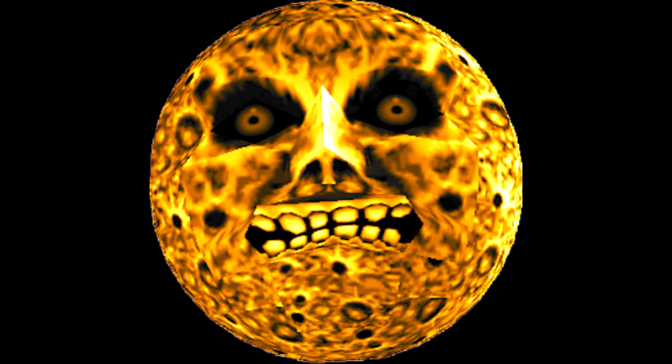There's another issue, which is heat. If you're playing outdoors and the temperature gets up into the upper 70s or 80 degrees, you may very well have your germanium box crap out on you. There is a solution: guys like Josh from JHS talk about taking a 1N34A germanium diode and connecting it between the collector and the emitter. Because they both do the same thing, if you flip-flop the diode and put it in reverse, it will provide an opposite result and balance itself out.